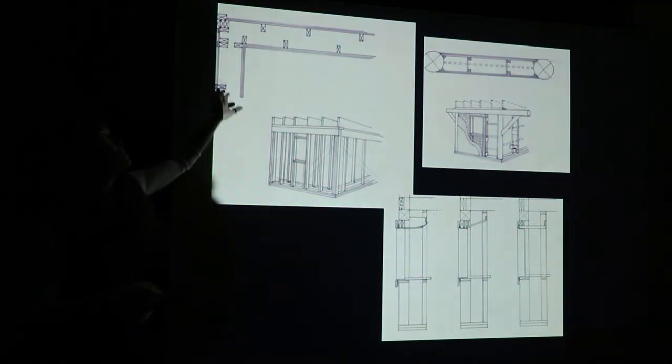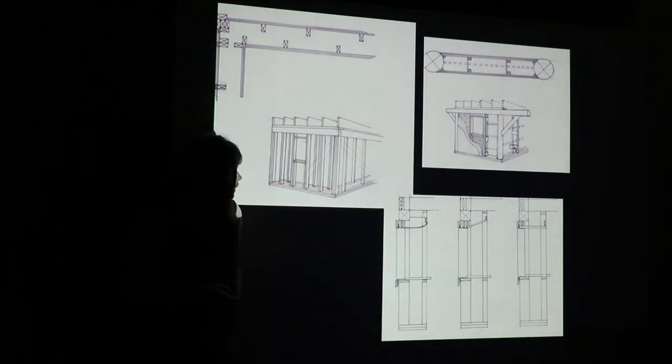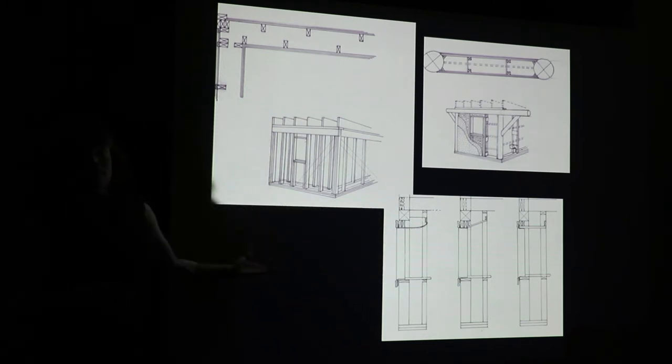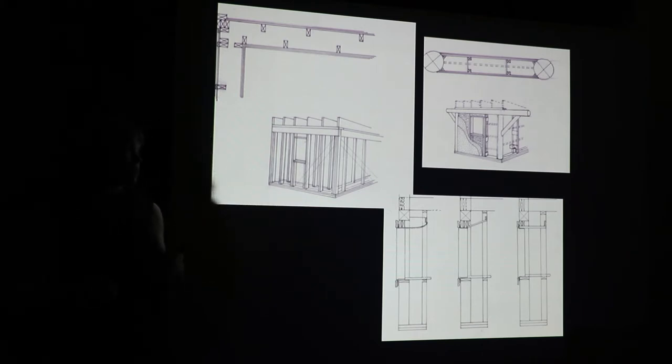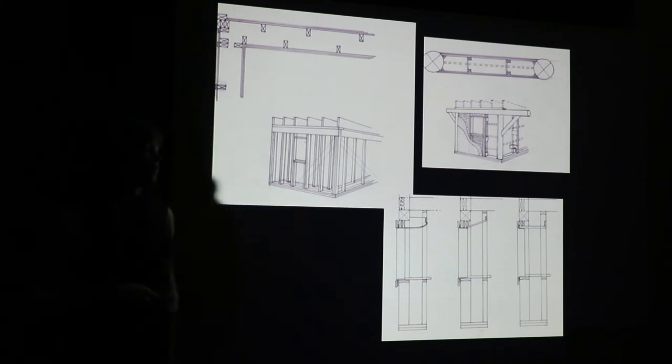Here are some architectural details showing where framing allows for continuous installation with straw clay. With my experience being primarily straw bale, there are a few projects where I've incorporated light straw clay. On the south side of any building where you're trying to make the most of passive solar design — lots of windows and doors — you have a lot of framing. Putting straw bales around framing means using a chainsaw, cutting notches, it becomes complicated. Light straw clay becomes a really great way to still get your insulation using straw and clay on the south side.